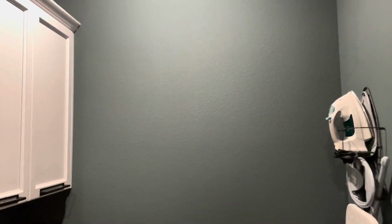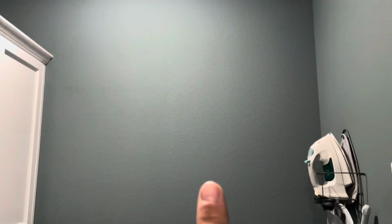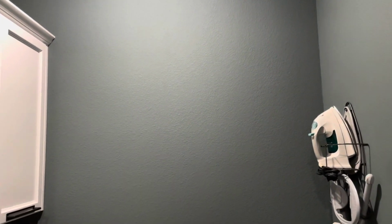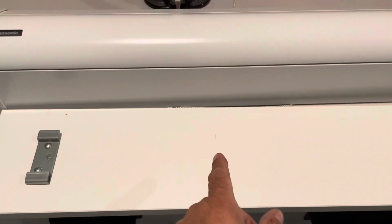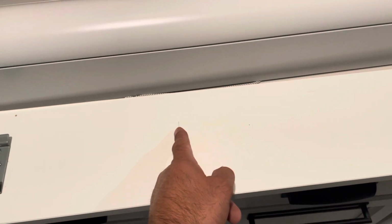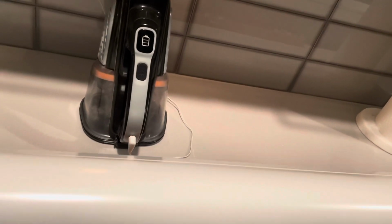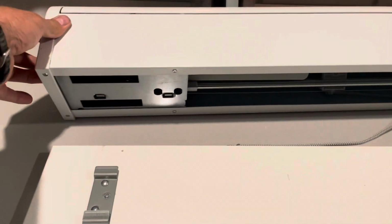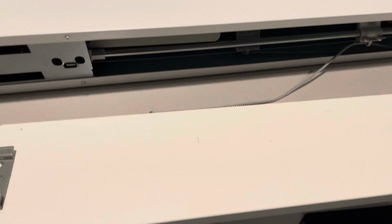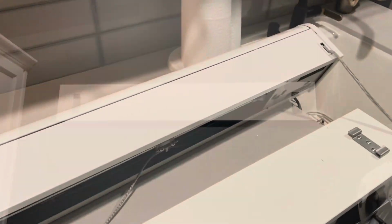So we're going to go ahead and install one of these Panasonic pull downs on this end wall here. And this is a perfect example. The stud layout on that is we've got one that's 13 inches in from the end, and then one that's 36 inches. That centers it in that opening. If we were left to the mounting brackets on this guy here, we would not catch either one of those studs. We would have to use Molly screws and it wouldn't hold. So I'm going to go ahead and put it up now.